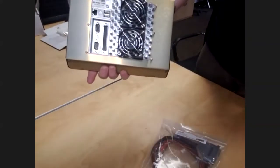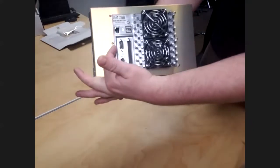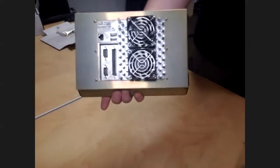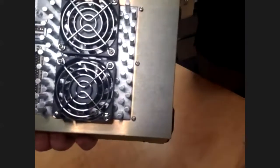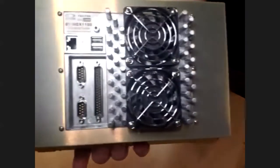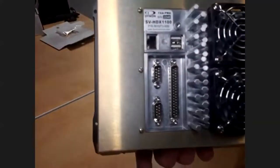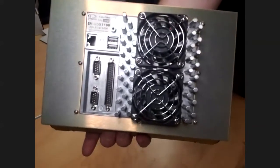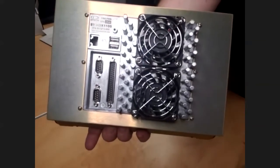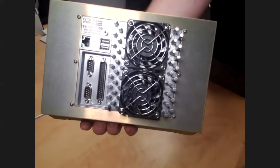The two 9-pin connectors, if you're a nerd like me, you'd think it's a serial port. It's actually what we call a SkyView network. It's got dual redundant data and power so that if there is something amiss in the system, SkyView can tell you about it and go to the backup data path. So, let's say you have a wire fraying on a piece of metal somewhere in the airplane, you won't be affected by that as it cuts through wires.